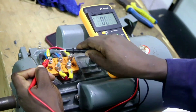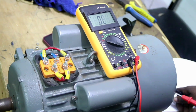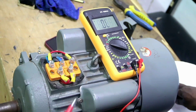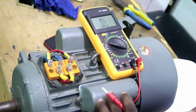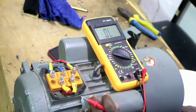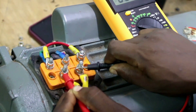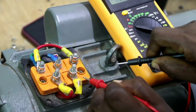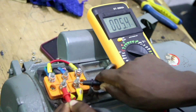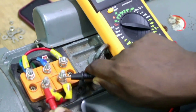There is no open circuit between Z1 and Z2. This means that internally the start and the end of the starting winding are okay. The second test is the open circuit between the running winding. The running winding starts from U1 and ends at U2. As you can see, there is no open circuit in the running winding between U1 and U2 — that is very okay.